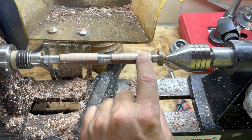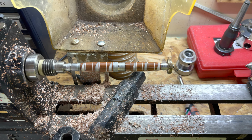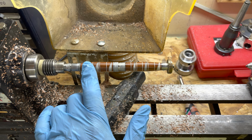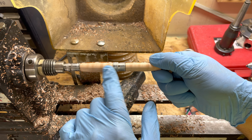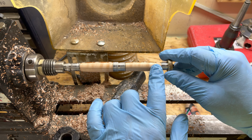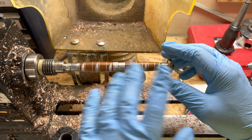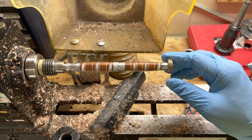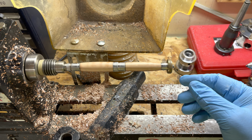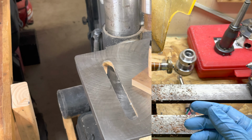Like that blurred in there. Okay, my phone overheated. So this is what that looks like. I actually had some blurring, that aluminum blurred into here. So I had to stop, start over. I stripped it or sanded it down. I put two coats of thin CA and then hit it with the accelerator and then went back over it with the wax. So that's what that looks like and how we got it to that point. I think it looks really good. We'll go ahead and assemble it next.